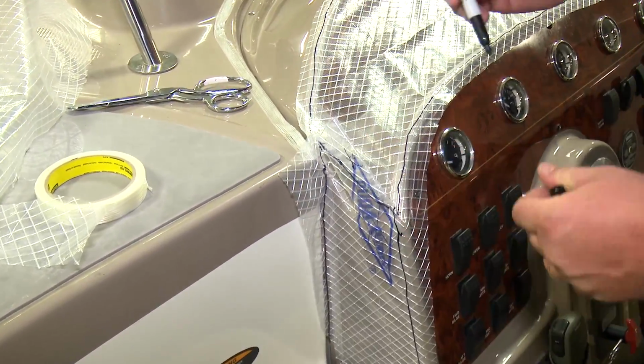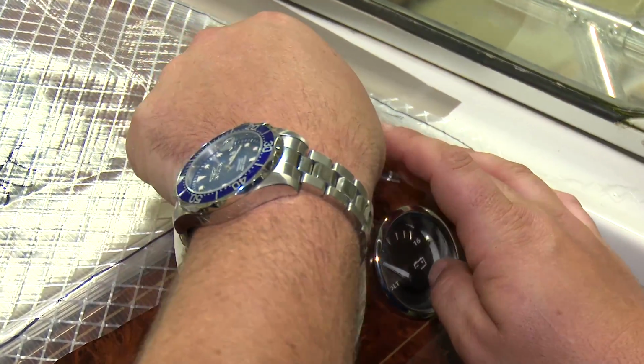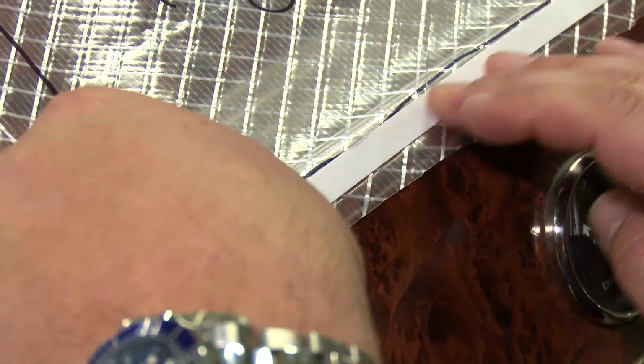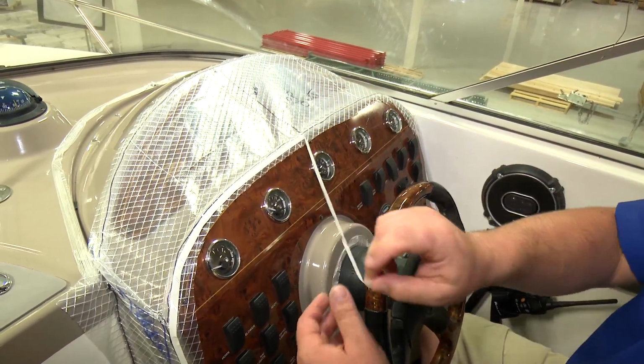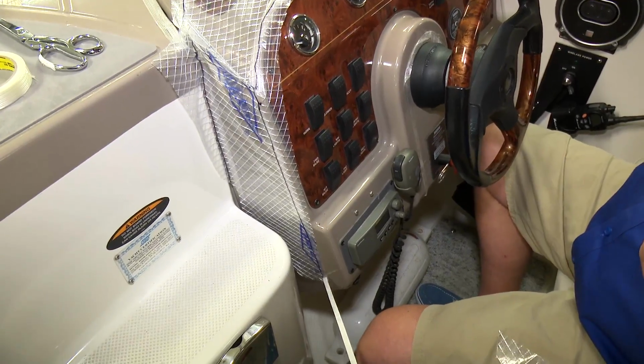To prep for the next panel, seam stick will be placed over or very close to the seam line we just struck down on the first panel. If placing the seam stick on the marker line, it may remove some of the ink when removed, but usually not too badly that it cannot be retraced later on.